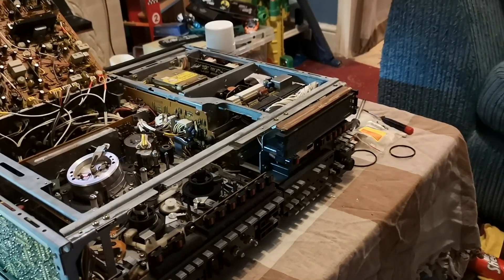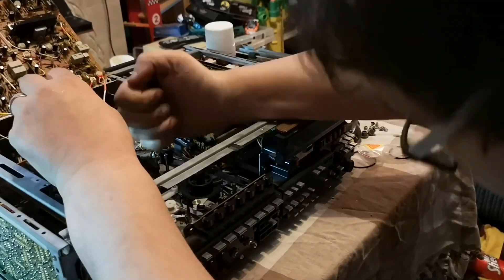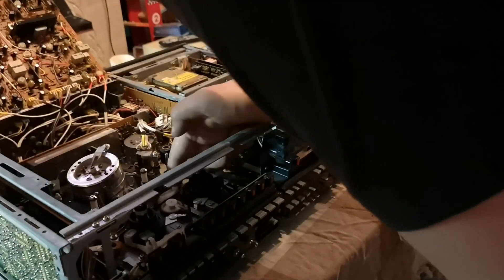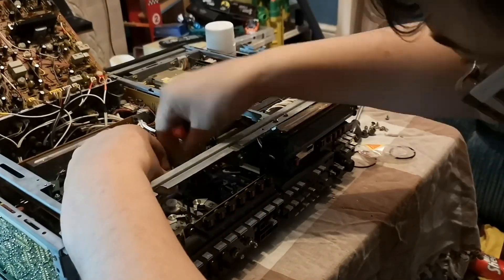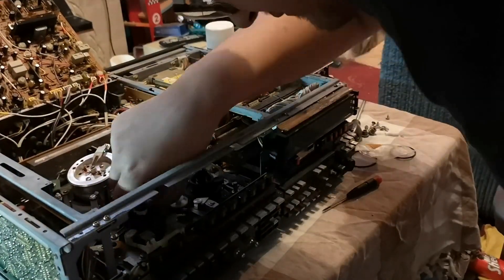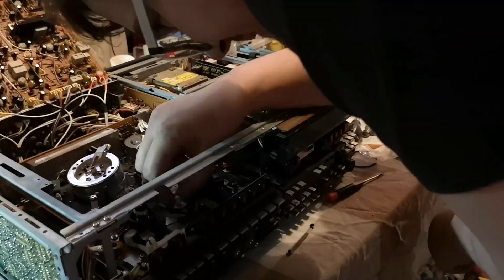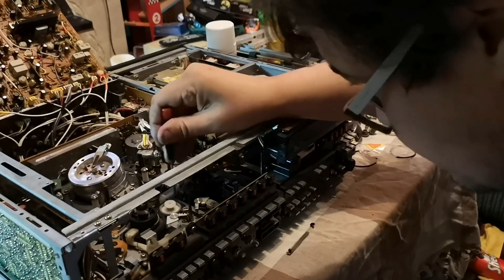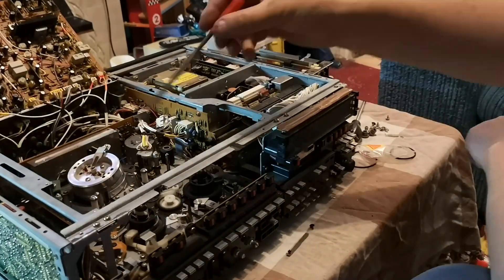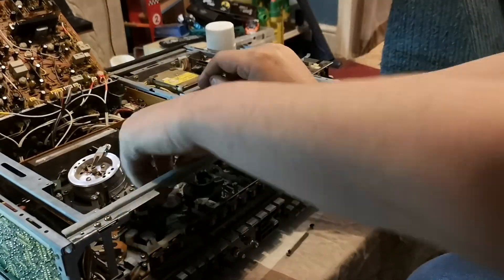After trying to get it to work, I decided to move on to the Multi-broadcast machine, which initially seemed a lot better and actually turned out to be in much better mechanical condition. It needed new belts, so I fitted the capstan drive belt recovered from the 3v23 — basically a brand new belt that had been on the machine but never seen any service. I haven't replaced the idler as it didn't seem to need replacement, so I've got a spare idler, which is quite handy.